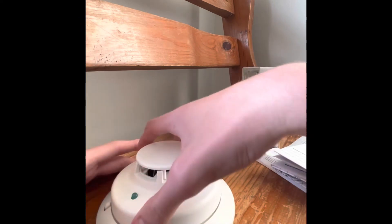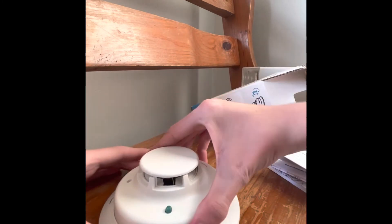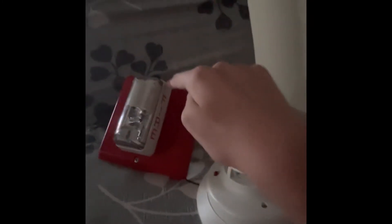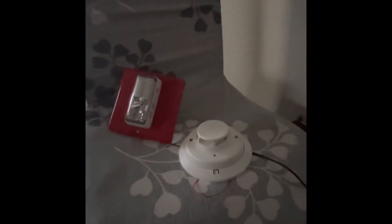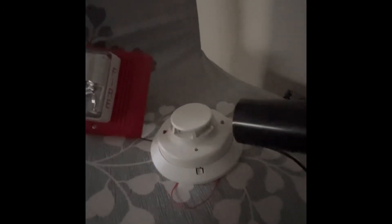I'm going to wire it up with an alarm right now. I've got the System Sensor i3 wired into my ESD Integrity Power Saver speaker strobe via an adapter. I'm going to use Smoke Saber to test it. We'll test it with the i3 — the strobe light will be flashing but no audible. So we're going to spray some smoke at it.